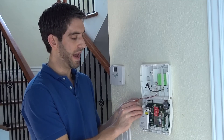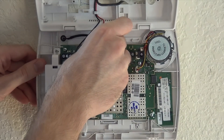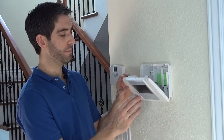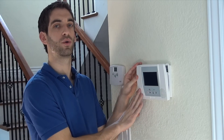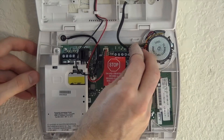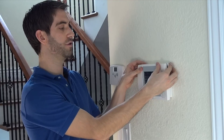The last thing you want to do is power it back up. We always recommend plugging the battery in first, otherwise you may generate a low battery signal. The battery will not power the panel up on its own — it will only hold it up if you lose AC power once it's on. After the battery is in, plug in the LT cable and you can close your L5100.